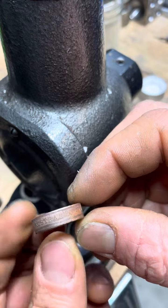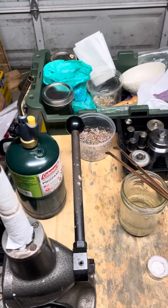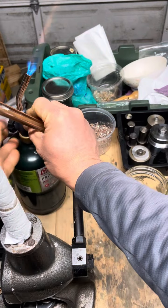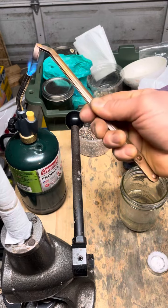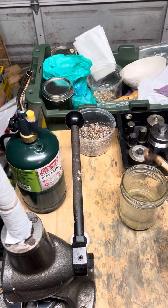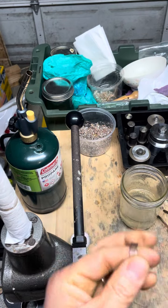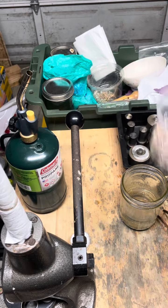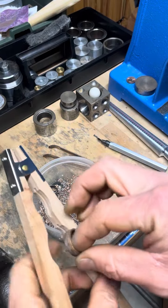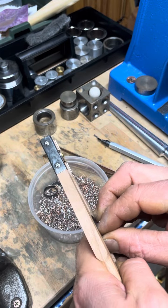It's looking pretty straight right there. Let's go ahead and anneal so we can get some of that wax off, then grab our deburring tool and trim off that inside edge. This coin is actually pretty thin so there's not a lot of material on the inside, but we'll trim off what's there anyway.